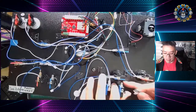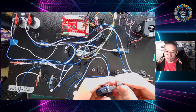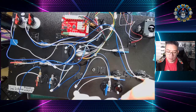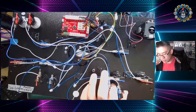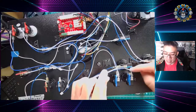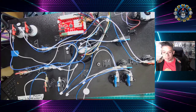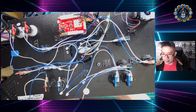brittle. So in order to get this mounted, I'm going to unscrew this and then put the blue wire on this long one here. And then this is my ground on the top, just like that. Okay. And then from there, I'm going to screw it back in or click it back into place. So this one, again, if you see it, you need to use that bendy one with the heat shrink tube on this one alone, because it's going to hit up against everything. All right. So now all the wires are here. Let's get everything wired up.